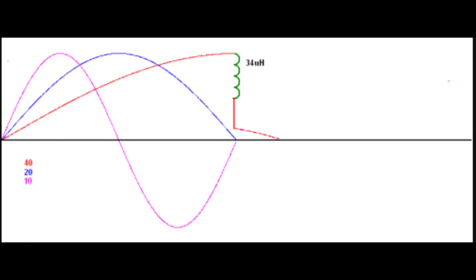In terms of the RF and the antenna currents themselves, as you may have seen from a previous video of mine — I'll post a link — I put a video up of a 10 metre long vertical for 20 and 10 metres. 20 metres is a half wave, 10 metres is a full wave. And that's what that first 10.1 metres actually does for you, up until the coil. And then, as the coil, you've basically got a bit of loading for 40 metres. Now, normally, if that was a 66 foot long antenna going upwards, you'd find a current maximum about halfway up. But of course it's a shortened antenna, so you can see that the current peak actually gets choked off, literally, just as you get to the coil.